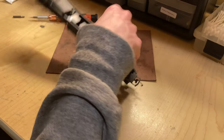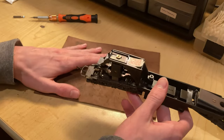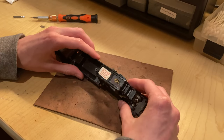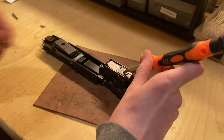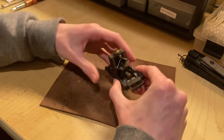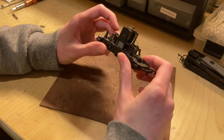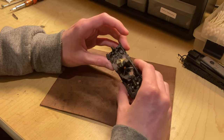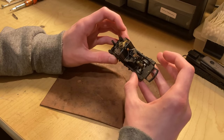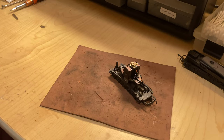I was also just looking at this, and it looks like there is a specific way to get this motor out without unscrewing it, so I'm going to see if I can follow these instructions and actually get it off. That worked pretty well, so I can move that aside. Now I can try and figure out this whole drive system, which is quite unusual — I don't think I've seen anything like this before. I'm going to take a second to look it over and figure out anything that needs to stay the way it is or that I could mess up putting it back together.